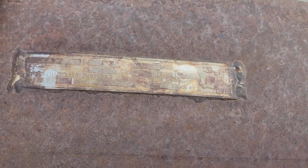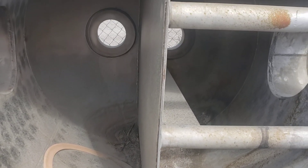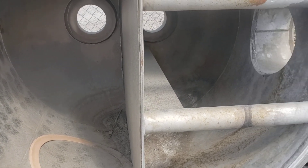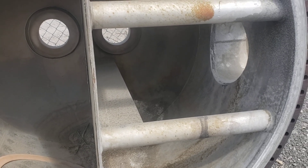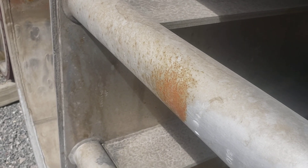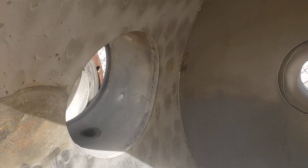Ladies and gentlemen, wanted to show you this heat exchanger bonnet — it's a duplex lined vessel, 310 stainless on the inside and carbon steel external. Notice that the center baffle support has got stays and braces; it's not real common to see bracing this big. This one has been repaired multiple times and was then retired as the cladding had worn down to its thickness.